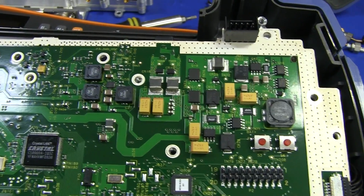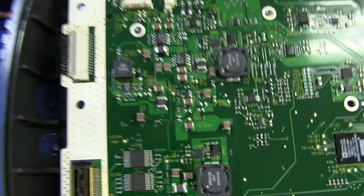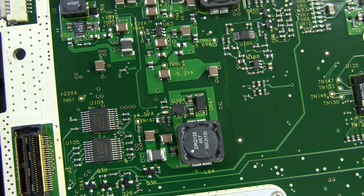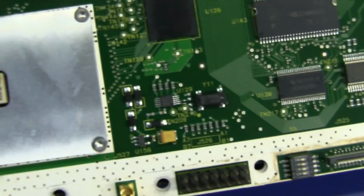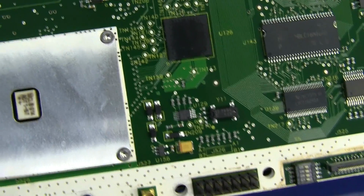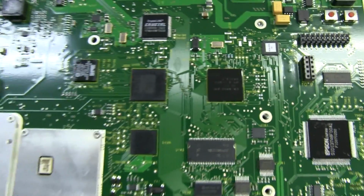And then we've got some nice looking power supply stuff up there in the corner. Beautiful, nicely laid out. High current traces, you can see that. We've got more power supply stuff happening over here, and lots of little local regulation and core voltages everywhere. But yeah, that pretty much does the business. It looks like we have a real-time clock down here. You can tell from the 32 kilohertz watch crystal down in there by the looks of it, and a little tiny package external RTC, and that about does it for this side of the board.